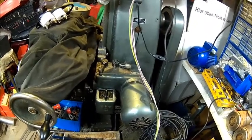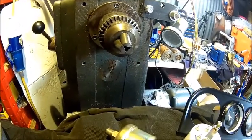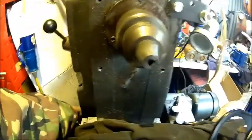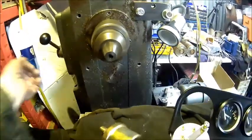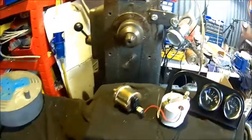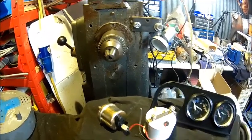We can try a full reverse on the mill — I don't know if it pops the fuse or not. I've changed the current settings on the drive a little bit, we run it with a slightly higher current, and I'm going to do an instantaneous reverse. And it does it. It's a bit tougher now, but the limits are up to maximum and it just comes on and runs nicely without limiting anymore.